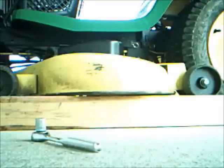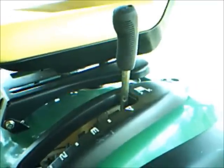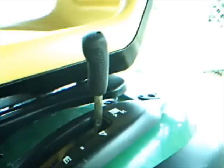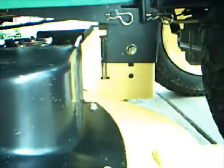We're going to look at removing the clips now. We're going to lower the deck with the deck adjusting lever here, because we want the tension off of the brackets that we're going to unhook from the clips. Because if they're in tension, then you're not going to be able to get the clips out. So we lower it, and then we start at the back — you can start at the back or the front.